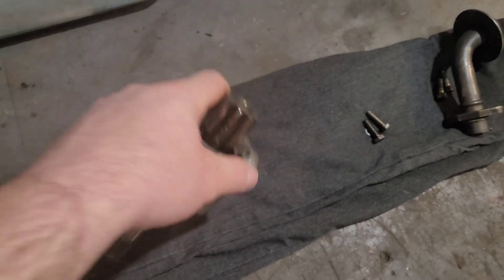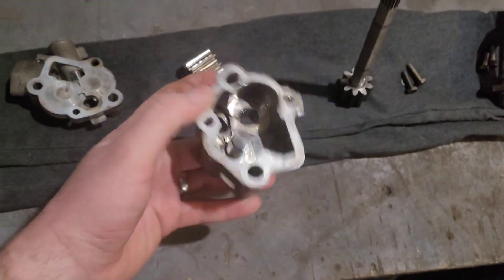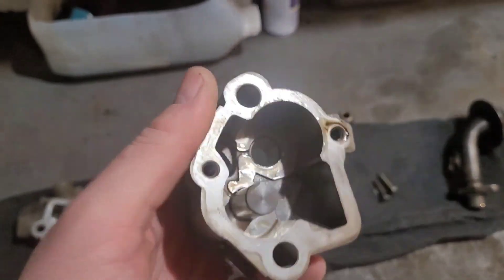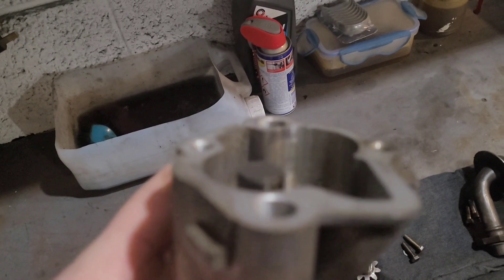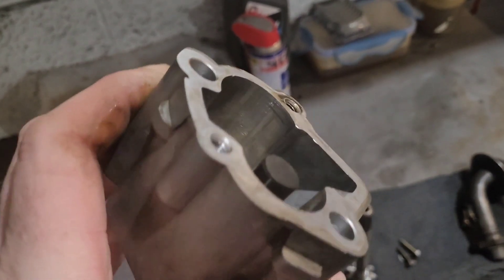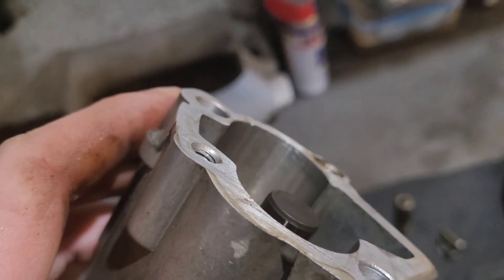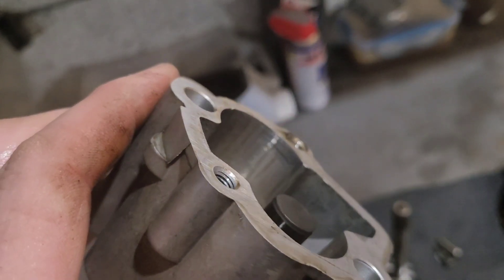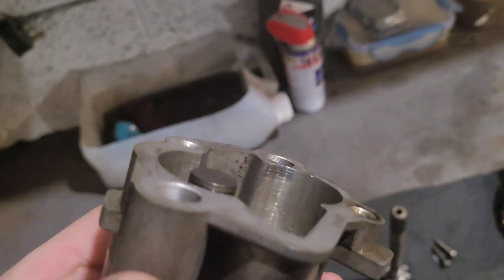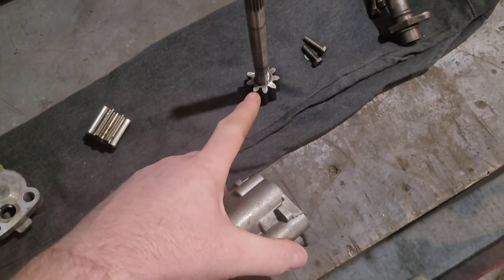Now the reason I won't reuse this again - it comes apart easy, just moves up and the other one comes off. That gear was on here and went through that hole. Now this is what poor machining looks like - the machining of that hole causes problems. If you zoom in and catch the light - see those lines? That is the pump gear touching the housing.